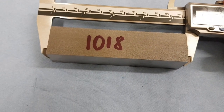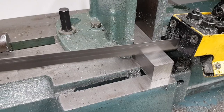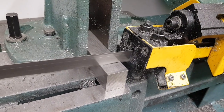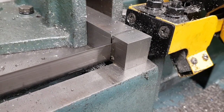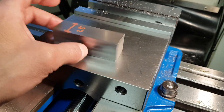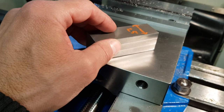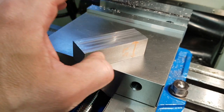It's 112mm long, so we will cut off about 20mm. It's just wide enough and just high enough. I'm squaring up this block and I've done two sides, so now it's 25mm. Next I'm going to do these two sides — they are going to be as much as I can get out of this piece, probably 27mm and change, because this will sit like that in the turret in the lathe.